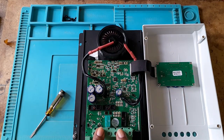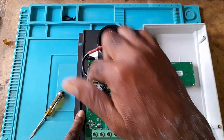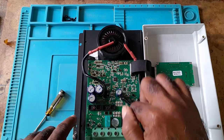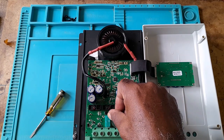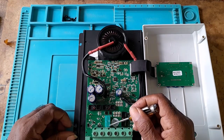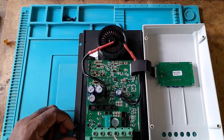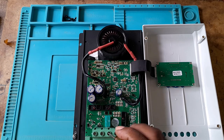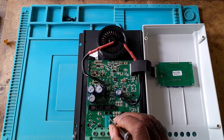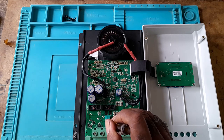To get this board off the heat sink, take out these four screws. There are MOSFETs underneath here. If you put your tester on the fuse — here and there, on either one of them — you would get continuity. I think it's the positive lead: put one lead on the positive and connect here, and you will get continuity. That means your fuse is good.